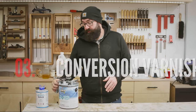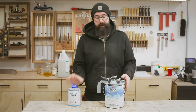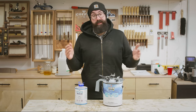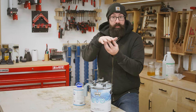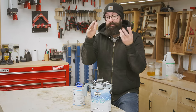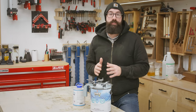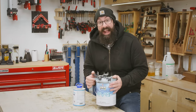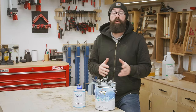Let's talk about the most durable finish of the three: a conversion varnish by Gemini Coatings, specifically a 2K conversion varnish. The '2K' means it's two parts — the conversion varnish and a hardener, much like the hard wax oil. The difference is this is a film finish and it is bombproof. We use this for conference tables, restaurant tables, and pieces that are going to see a ton of traffic and a lot of abuse. Now let's talk about the downsides — and that's literally everything else about it. This is a film finish that builds a layer on top of the wood; you're building that layer up with plastic, and if you build up too many layers it looks really bad and fake — you can tell there's a film finish on it.